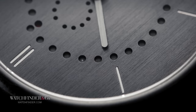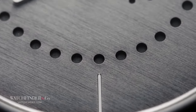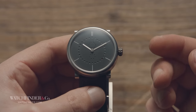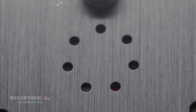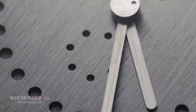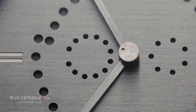All good questions and the answers are surprisingly simple. Normally, an extra display would require at least three different parts: the display itself, the wheel to drive the display, and something to hold it in place. Here, the wheel is the display, with the print applied straight to it, and it's held in place by the dial itself, which has been modified to house it. The second question is not only simply answered, but what at first seems like a flaw has actually been turned into a feature. The hour mechanism with the modified collar drives the weekday wheel forward once a rotation every 12 hours, and so with some clever placement of print, the day display is also a day-night display.